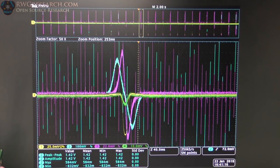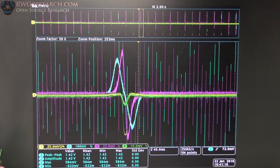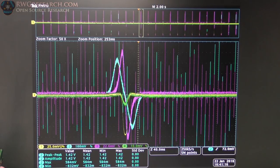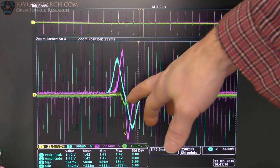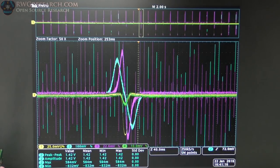So the results from that test are here. Now, I don't know what all this noise is. I don't know where that came from, but just ignore it. It's just background noise. I believe it's an AC line from somewhere. It's right at 160 peaks. Anyway, so this is what one peak looks like according to that configuration. Okay, and you can see how this goes up, down, and up, just like our coils configured in the very first test, where we had the same result. Now, there's a very interesting thing here that I want to point out that is very critical, and we'll look at that on the last slide. Let me go to the next one.